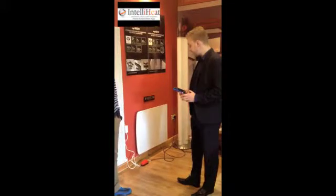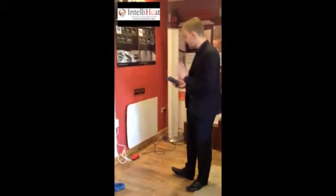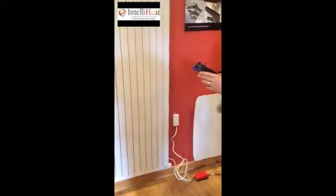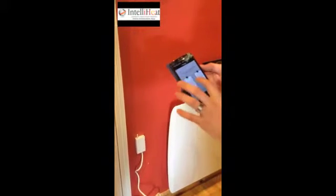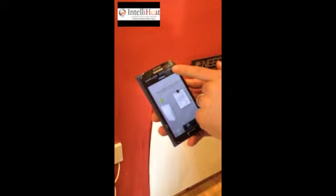What we're going to do now is connect up the receiver to the control pad — namely the phone. We're going to make sure the receiver switch is on, plugged into the radiator. What we're going to do is put it into learn mode, so press and hold that for three seconds. It's got an intermediate flash — that's in learning mode. Now on the app, go into the heating section and select which type of product it is. We're going to choose the receiver and click next.